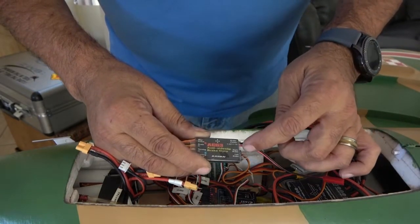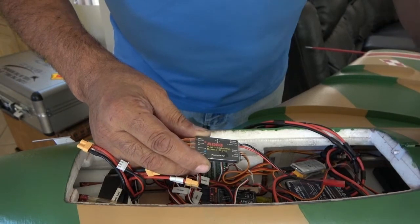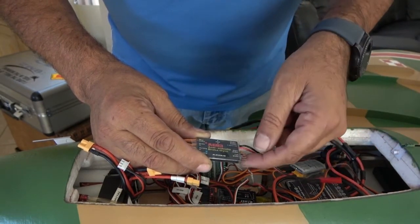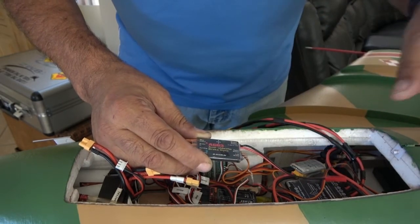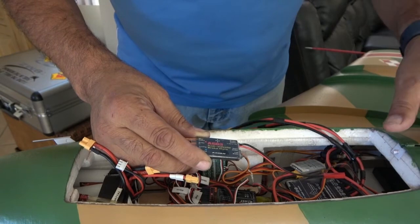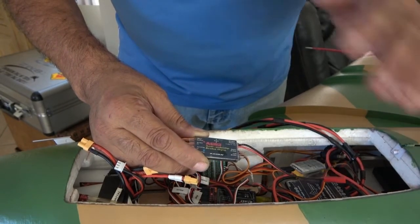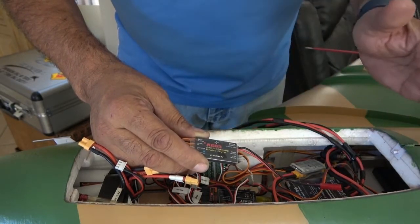There is a right and a left brake channel, so you have to make sure you connect the left wheel and the right wheel in the correct spot, because that's how it's going to help you brake independently. If it's going to the left, it's going to apply brakes — let go of the brakes on the left and apply more on the right. This is crucial in order for the plane to steer correctly.